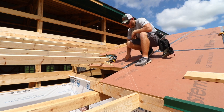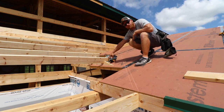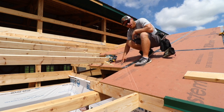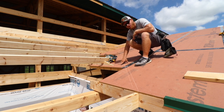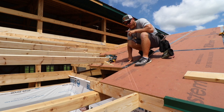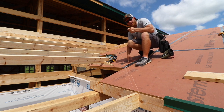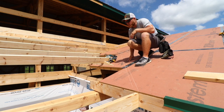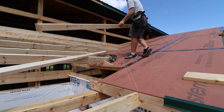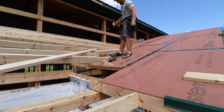If my math is correct, I've got two lines: I've got my valley line, but I also did some math to calculate where the tops of these are going to plane into the sheeting - that way when I put my 5/8 zip sheeting on top, the plane should be right here. Math never lies but sometimes you mix up the formulas or angles, so I just like to double-check everything. I hate rework - I'd rather spend a couple minutes now doing the math than eyeballing it and having to make new cuts. I'm going to go cut these purlins and if I pitch-cut them correctly they should die right into my marks.